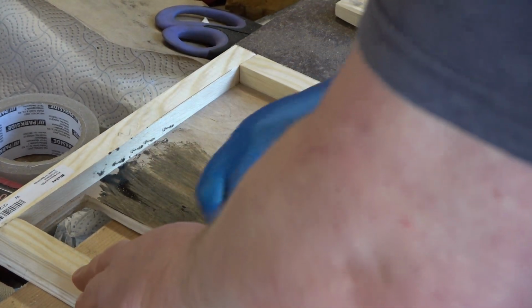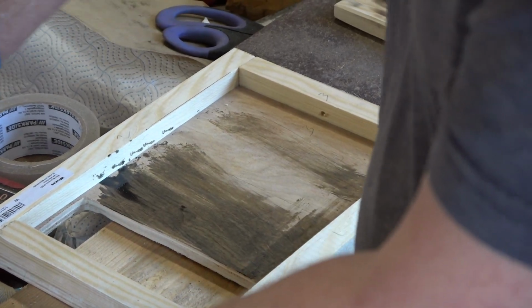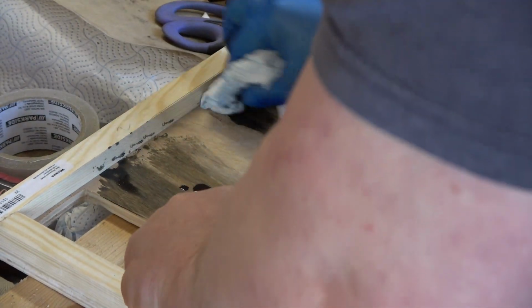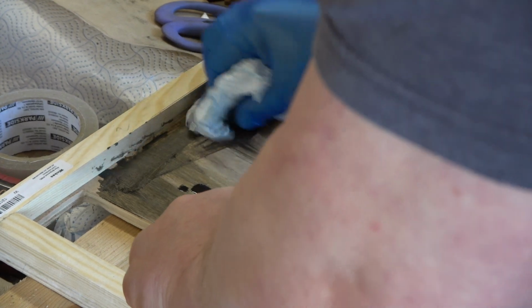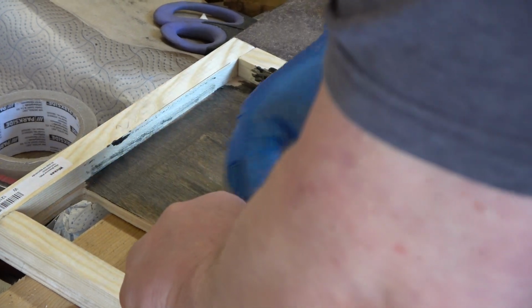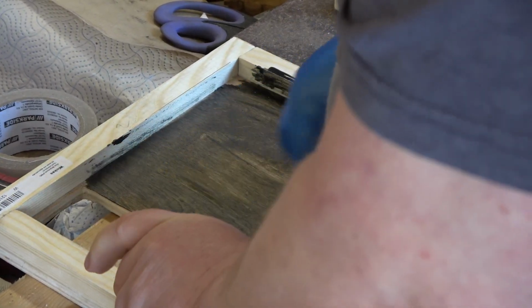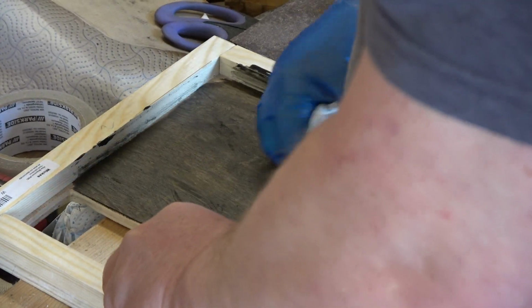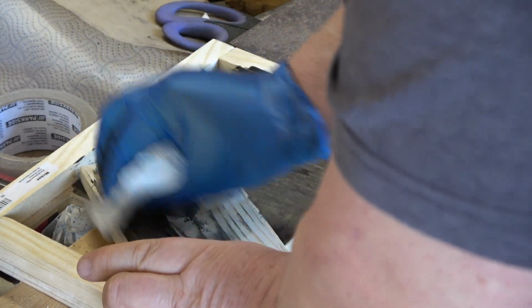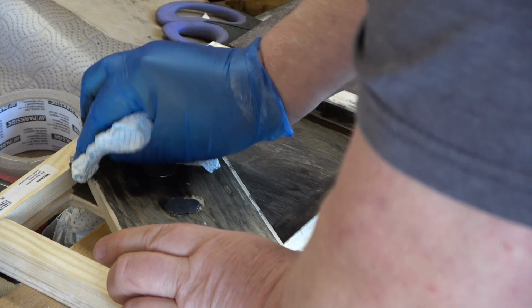And there's a chamfer on that edge because that can cause wind noise if you don't do that. So the next thing we're going to do is apply what we call black lead. What do they call it? Well, it's graphite, which is suspended in methylated spirit. It's about £97 a tin, but it means that the surface is lubricated. If you wonder why it's blackened there, the lead caused it to catch fire. Not surprisingly. So let's hope that I've shaken this sufficiently over the last 5 minutes.